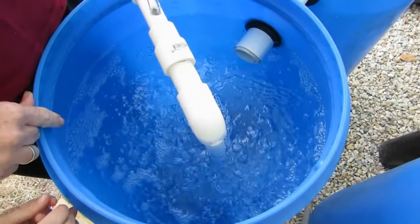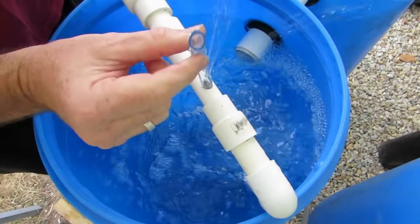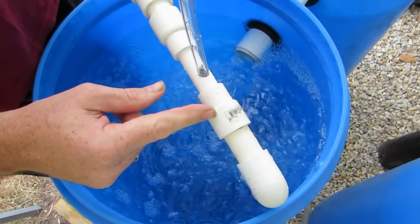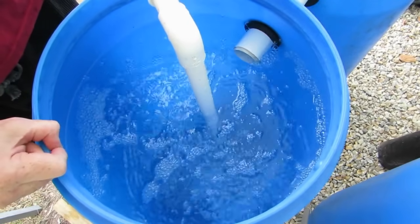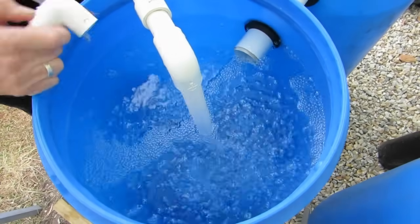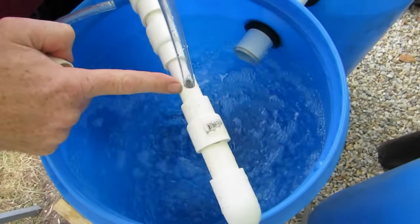I had a quick think and made up a very quick little venturi — water coming from a 25mm down to a 20mm and then to 15mm pipe, with an 8mm rubber hose pushed through into the pipe going down to about the end of that fitting, with a little bevel cut on the end. The airflow is pretty much the same as the straight elbow variety. If that's all the fittings you've got, it works fine — the hole's a bit sloppy and there are a few drips, but if it's over the top of a fish tank you're not losing anything.